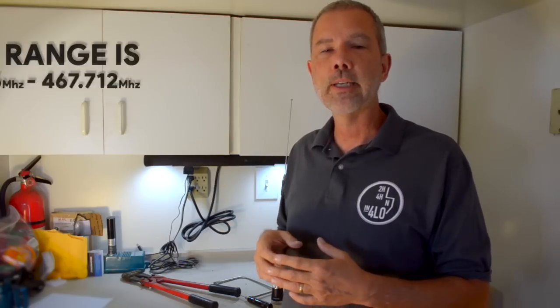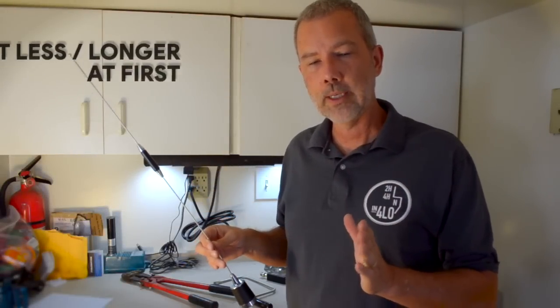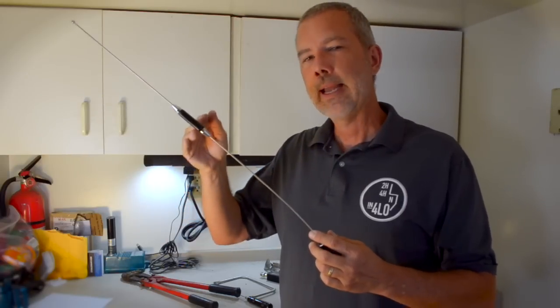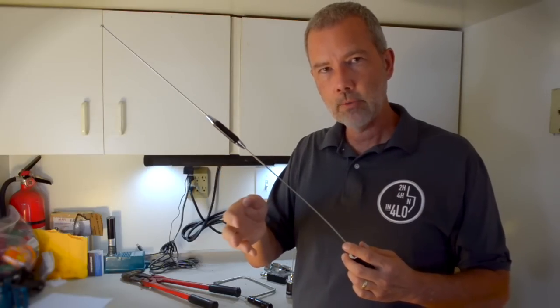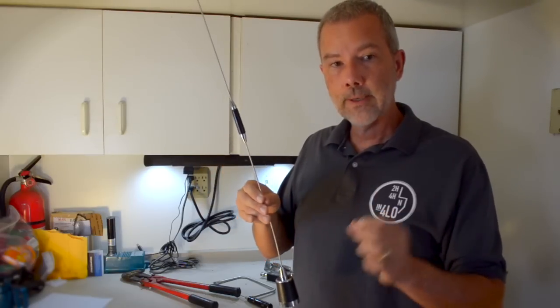Because the instructions will tell you pretty much how much you need to trim off the antenna for the frequency range you're using, you don't need to do it the way you might have done it on a CB — measuring channel by channel. We're basically going to be shortening the antenna until we get to the lowest SWR we can reach. When you make your initial cut, you want to cut it long. Make a cut close to the target length, measure your SWR, and then slowly take more and more off — a little bit at a time, measure, a little bit more, measure, until you get down to that perfect SWR.